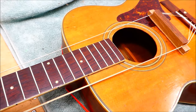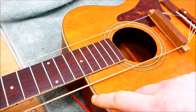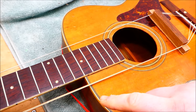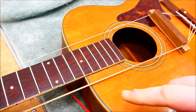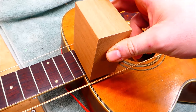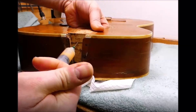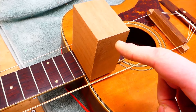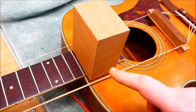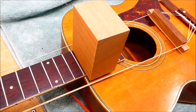My brain hurts. I was inspecting with the mirror, checking out the cleats, and I've uncovered something that just boggles the mind. It was reasonably well hidden — you wouldn't find it without uncommonly careful searching. But it solved a mystery, because I was thinking: if it was just the side crack alone that loosened things, that should have had little or no effect on the ability of the heel to rock away from the body the way it was doing. There's no looseness around the dovetail for it to do that. Looking at the sides of the block with the mirror, I see a savage little crack that runs vertically — it appears on both sides, which is like death.